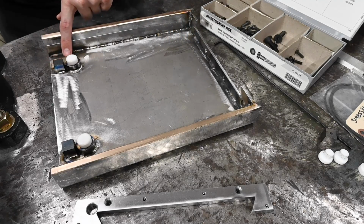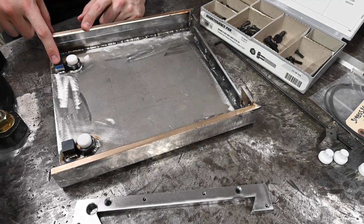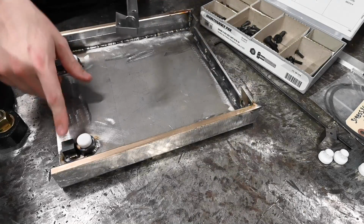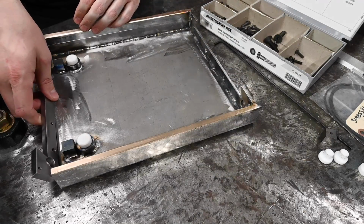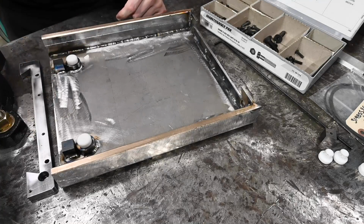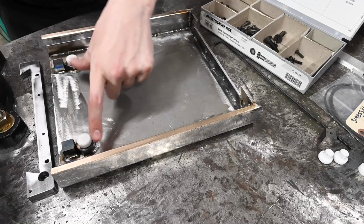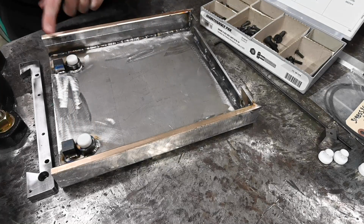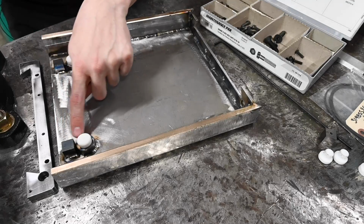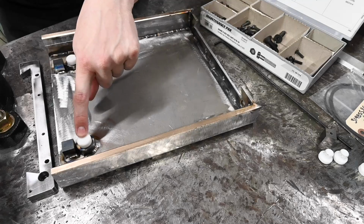You know, there's no reason for these to be two pieces, but what happened was I measured for and installed these two. So those are the lugs to attach this guy in its position, and I wasn't paying attention to where our glides needed to be. And it turned out that they were exactly in line. So I really, if I could go back, I would definitely make that change and make this one piece. That would just be a lot nicer. Those are our Teflon glides.